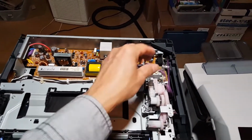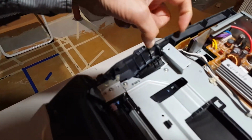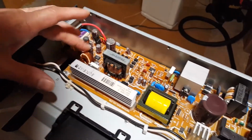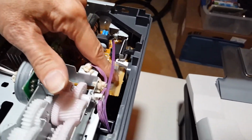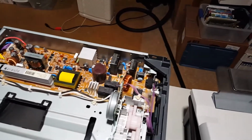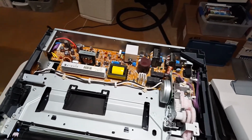So, relatively clean. I had to take that wire off, which is the switch for that. Still need to get to this side to see what on that board probably burnt up. So we'll try and take these screws off, but I don't necessarily see anything burnt up in here. The fuse looks dark, so I'll take a look at that in a minute. Can't imagine that would burn up and then flare up over here, but we'll find out. So I'm going to continue to undo things.